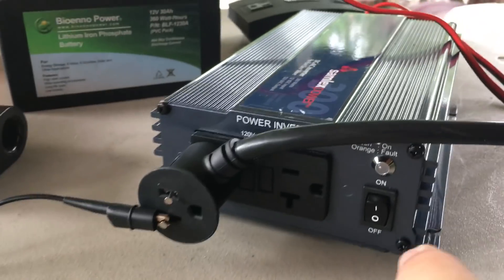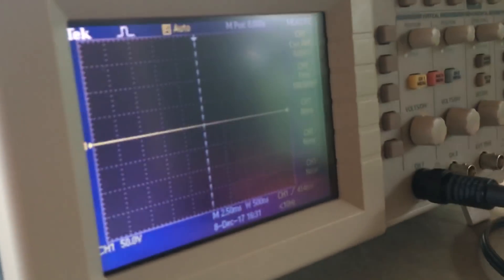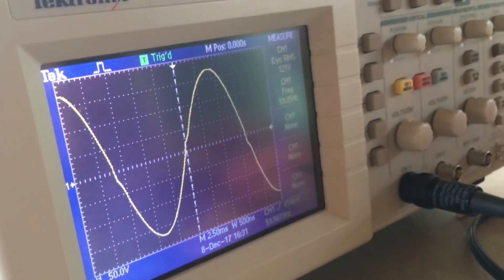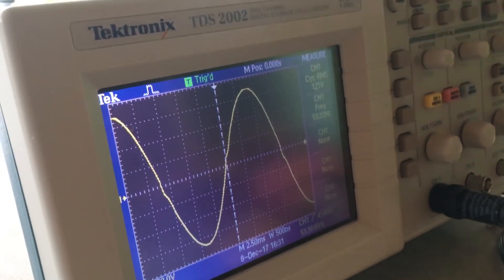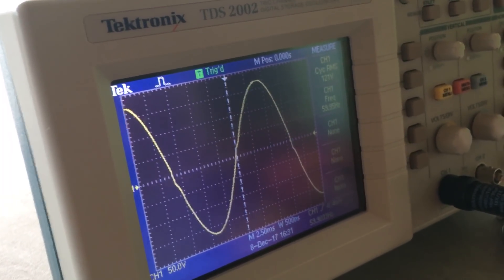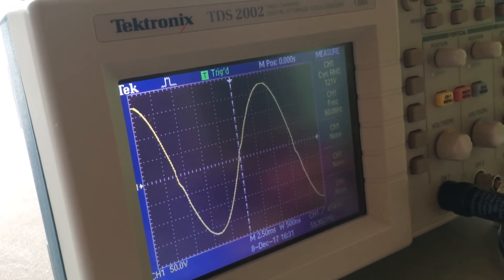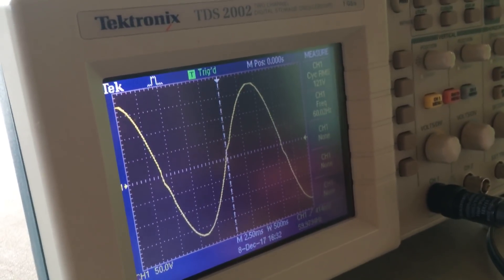Since we have 120 volts exposed over here, I'm going to reach over and turn it on. So it's on, but we don't have any waveform — we forgot the probe. We're going to connect the probe to it. Now look at that — what does that look like? Hills. Instead of a hairy rectangle, it looks like a pure sine wave! We have 121 volts, and the frequency is between 59.95 and 60.02 hertz. This kind of sine wave is much better for your computer and your battery chargers. Sometimes power tools, a microwave, or a small refrigerator won't run properly unless it has a pure sine wave.